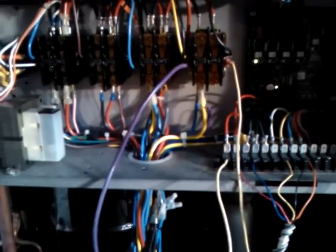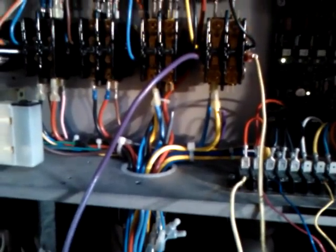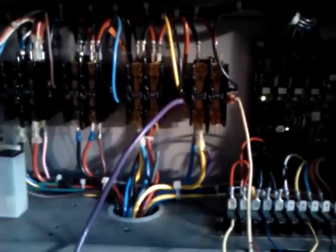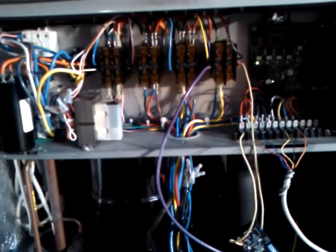The way this is set up, the L2 and T2 side of the primary one and primary two contactors was feeding the potential relays. What happens is we've got a high current running through the left side of each of these two potential relays and a low current running through the right side. I've got the right side completely disconnected with the new UMSR-50 setup. If you watch, what it's going to do right now is precisely what the system did with the potential relays wired into the T2 side — you get a very low current through the right side with no arcing, and a high current through the left side which creates quite a bit of arcing. That little bit of buildup on the left side contact causes the bar across the middle of the contactors to teeter.